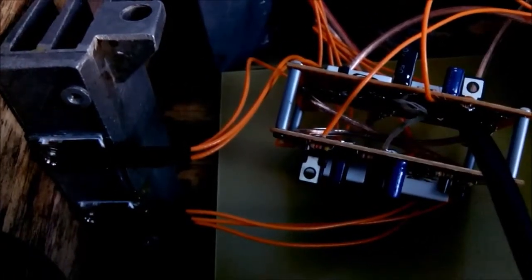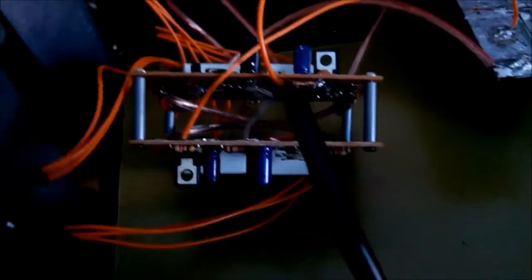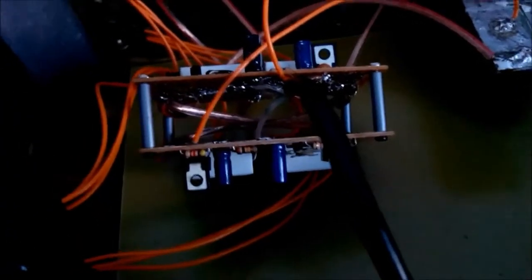It's a pretty straightforward power amplifier. I'll post a link to the schematic in the description. There's a power transformer which powers the power amplifier, a small transformer which powers the MP3 module, and an active tone control — I used the TL-084 op-amp. Here you can see a heatsink; it cools down the LM7805 which powers the MP3 module. I set idle current to 40 milliamps when cold, and when it heats up it raises to 70 or 80 — still within range, still Class AB.